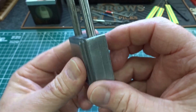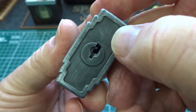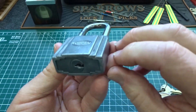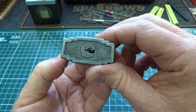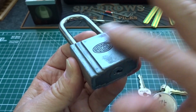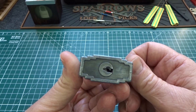What I thought I'd do is cut this open — we're going to have to cut it because when you look at the lock, there's a seam down the side, and on the top and bottom they've got these lines covering up what's probably a seam. There's no screw or rivets to grind off. They probably took half of the shell, put all the mechanism inside, put the other half on, and somehow sealed it up. I really don't know how they did that. So after we pick it, I'm going to clamp it up in the milling machine and start milling from the top, hopefully to get a look inside and see exactly how everything's laid out.